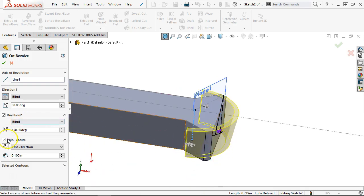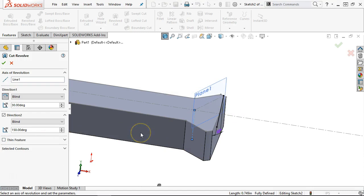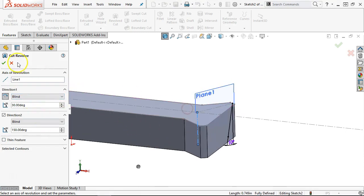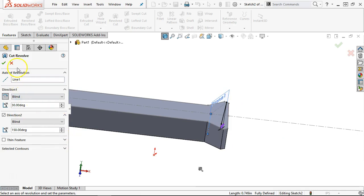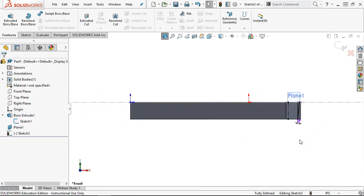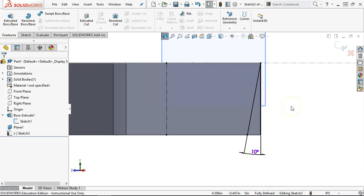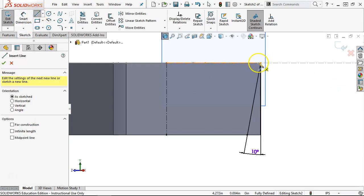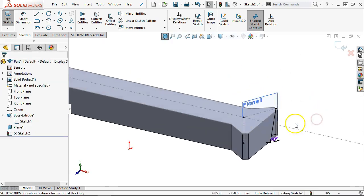It went to a thin feature — I'm not getting a direction arrow or flip side to cut. We're going to have to go back and close it off. The thin feature is trying to take a swipe, and I'd hesitate to just tell it it's a quarter inch thick. I'd rather define it — just go ahead and define it rather than give it some arbitrary thickness. Mainly, I don't trust it. So if I bring this over and close off the triangle, as long as it can intersect the rest of the geometry, I won't end up with any extra bodies or zero-thickness geometry.